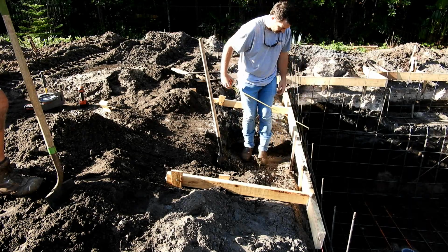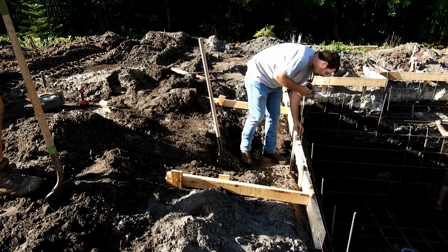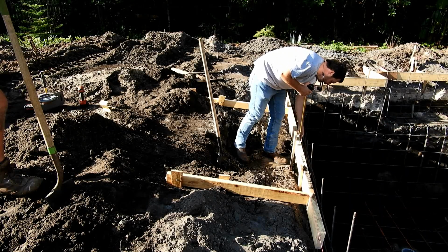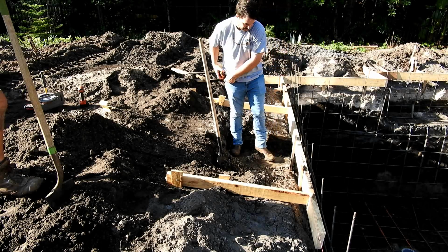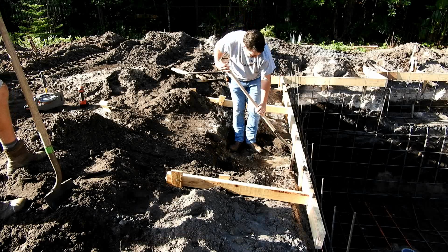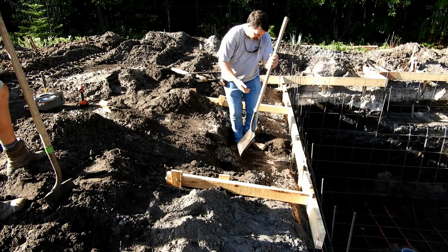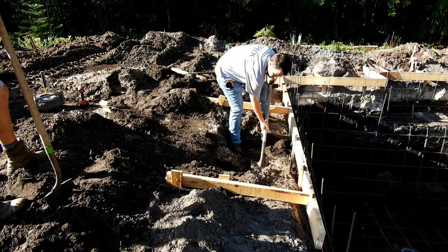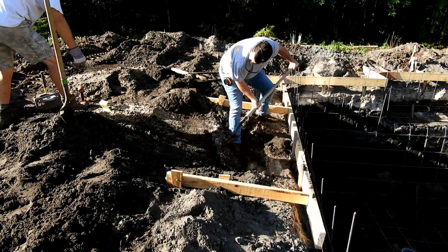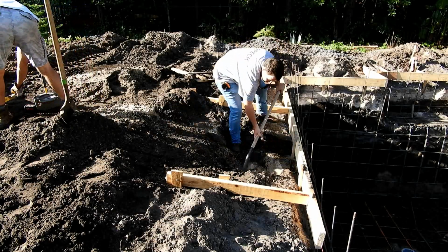For 2 and 3 jet systems, the jet housings must be installed as close to 10-inch center to center as possible for maximum performance. Do not install the jet housings more than 12 inches apart on center. Throughout the entire installation, make sure the plumbing connected to the BaduStream jet housing is well supported. Unsupported plumbing will crack the jet housing.